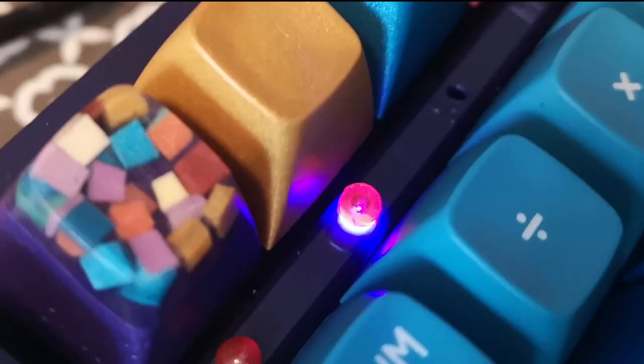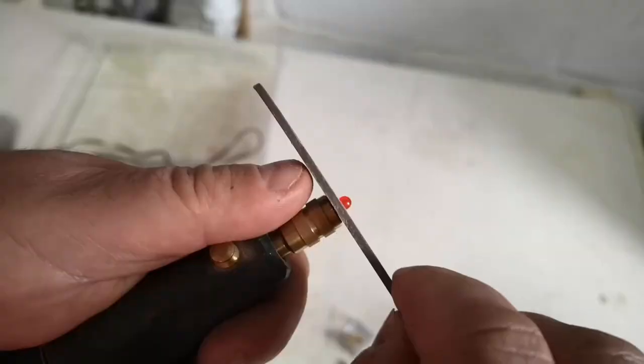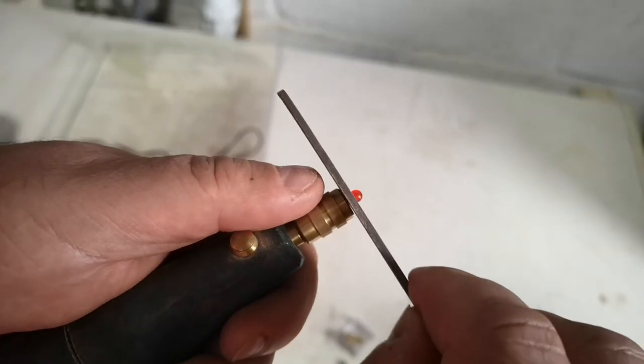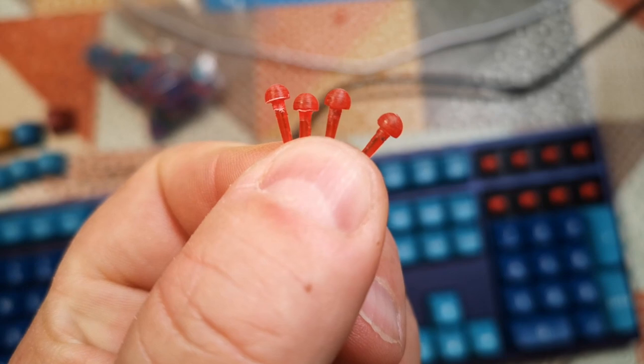So I just cut off the tail of the pin and pushed it into the hole, but it wasn't really an ideal fit and light leaked around the sides too much. So I placed one of the pins into my little handheld drill and used a small file to grind away half of the rounded pinhead and reduce the shaft diameter to be a close fit for the hole. After doing four of these — and I did break a few on the attempt, as they're quite thin and brittle polystyrene — I trimmed them up and pushed them into the holes above the LEDs.